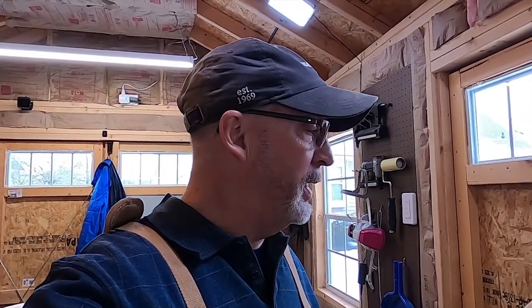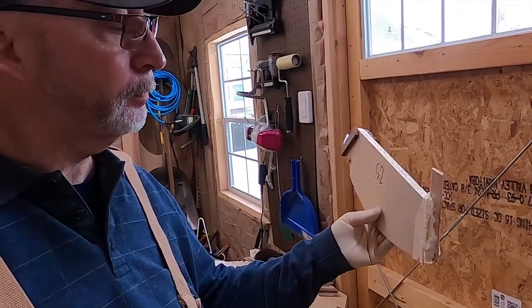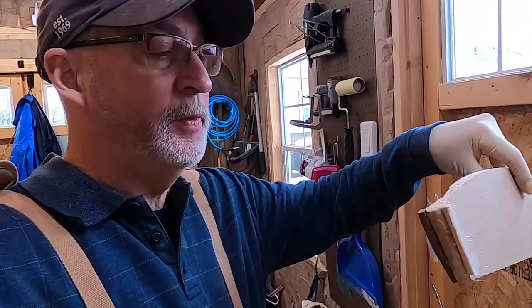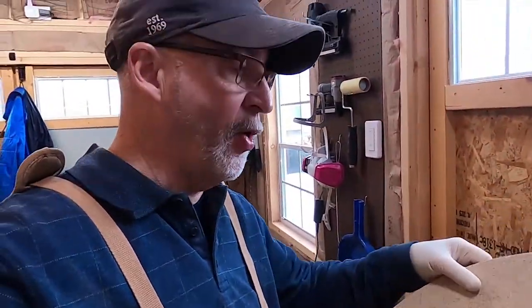But then the second part, your hull is going to flex a little bit. So what I ended up doing is I took scraps from the slats, and I just moved them in a little bit, started gluing them, and as you can tell by these, they just sat right in that hole. I really didn't have to worry about positioning them or even making changes to it. So take your time, make sure you've got what you need in the hole, and make sure that they're 12 inch on center, because I'm going to have to do a little work on the very first one, because the hole which you sit in is actually shifted back and I need to move it forward. That's not a big deal. It is wood, but that combing that's going to be around there is going to be a little different.